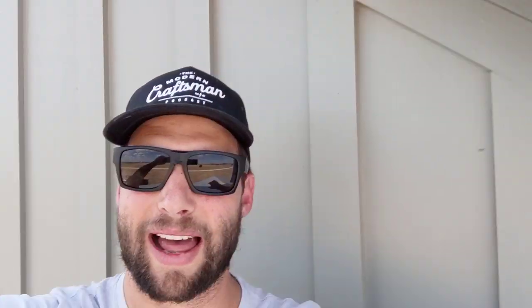So I've got several ideas on how to fix it. The front runner right now is something my HVAC guy gave me — he said why don't you attach all of those with rivets instead of roofing screws all the way through? So the current thinking is we're going to rivet these in hidden places up around and attach all of this securely so that when it blows you don't get that buzz. You'll have a solid piece of metal all the way around and it will quiet that vibration down. But I am all ears to hear what your ideas might be.